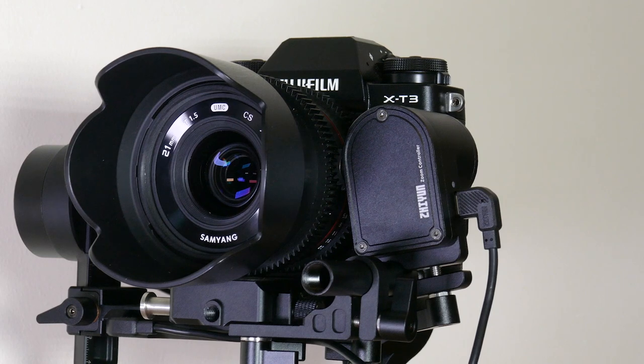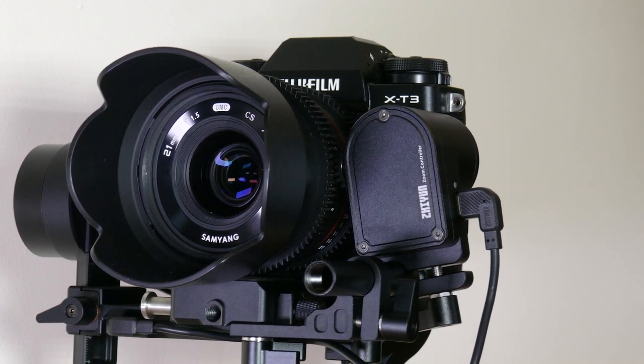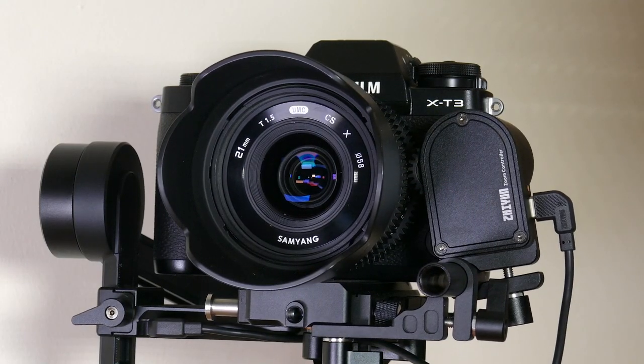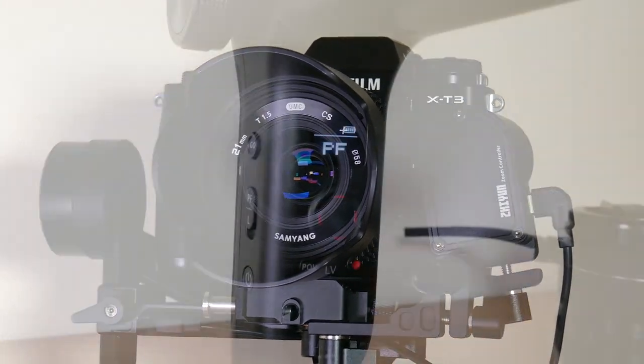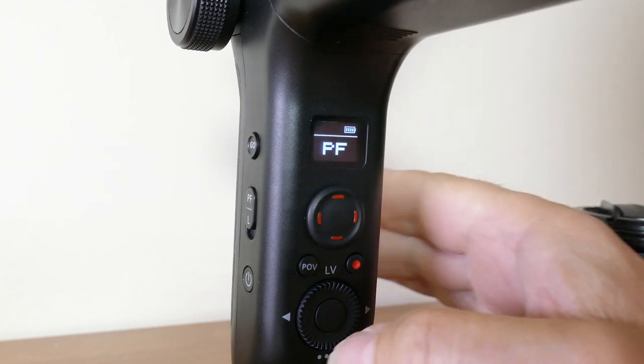and this is what you've got to be careful of. If you don't set the end stops, when it gets to the end, it keeps going. As you can see, and it sounds really bad. So right, what you need to do is set endpoints for the actual motor.